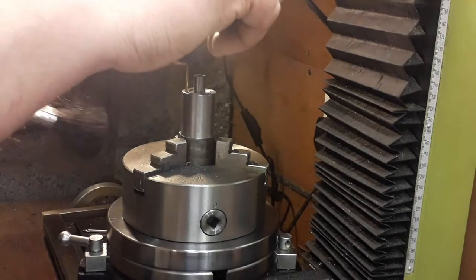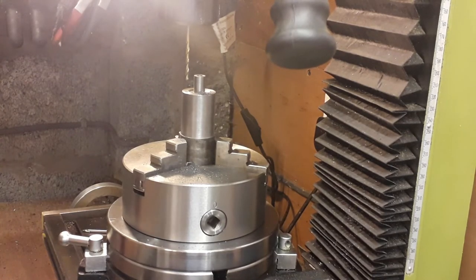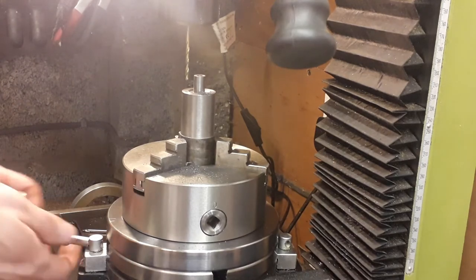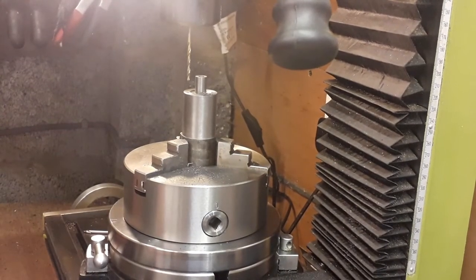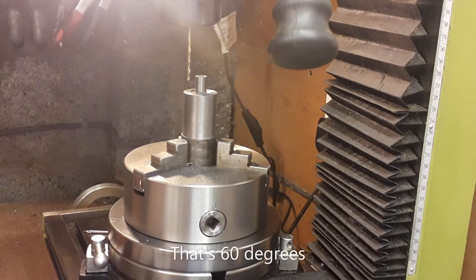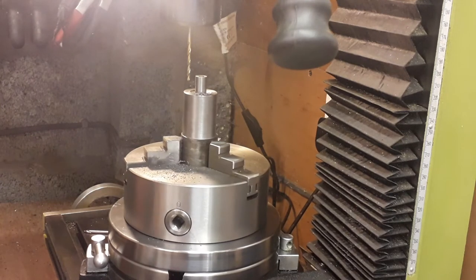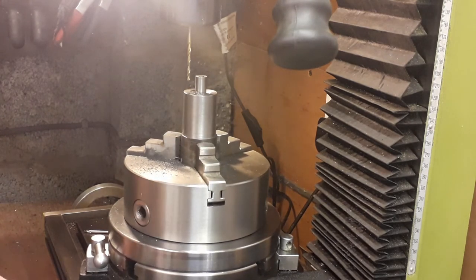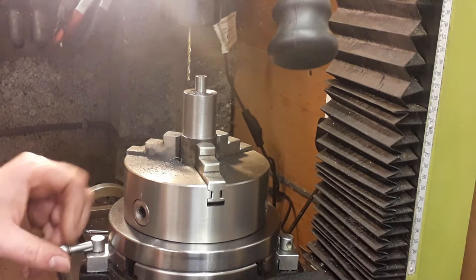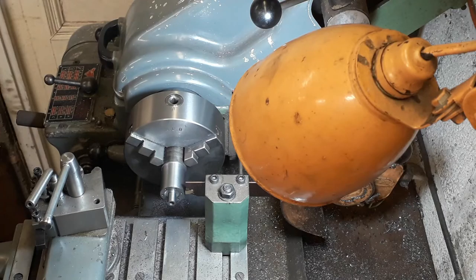We went about 20mm deep. Just make sure you do your measurements and clear those holes, allowing for your machining and parting off of about 2mm. We're just unlocking the rotary table and rotating 60 degrees. On my table, one turn of the handle is 4 degrees, so that's 15 turns of the handle to give us 60 degrees for the first hole. Then we repeat that for the other five holes. That's 60 degrees, lock it up, change your centre drill, move to your next hole, and so on. So there you go - that's six holes drilled. Simple process, just repeat.